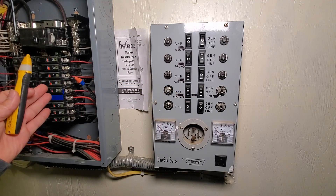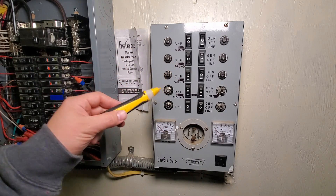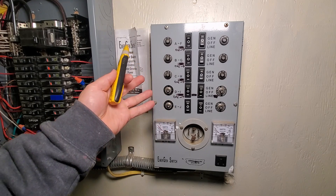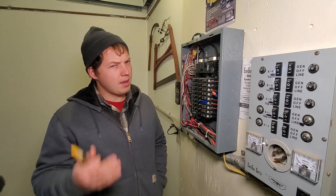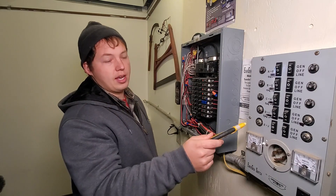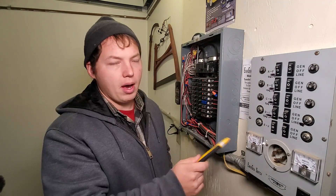Since it's not using the original circuit breakers for the circuits that are being bypassed, it needs replacement circuit breakers as if this were its own little panel, which it basically is. This system works very well for what it is. It's not my favorite system though, because it does have the limitation that every single circuit you want powered from your generator needs to be run through this box.